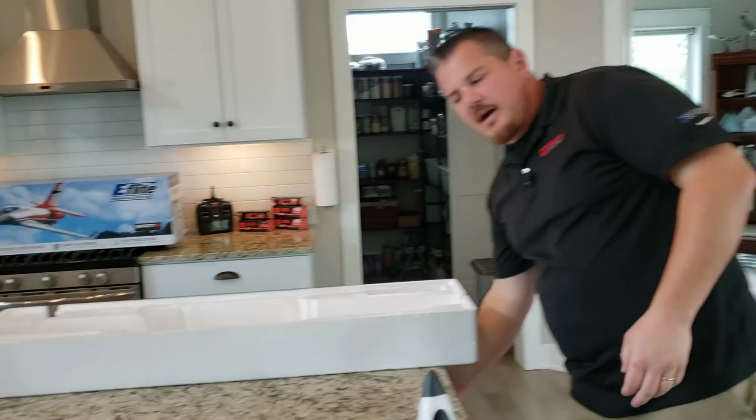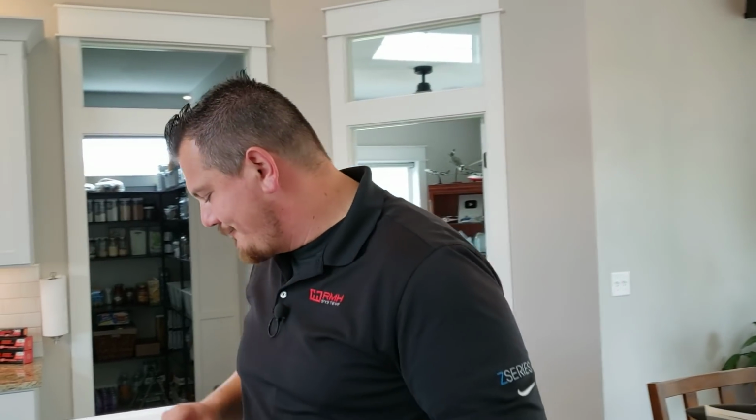Now that being said, another thing too, the other day I was pulling an AR631 out of a plane that may or may not have been destroyed by me. Anyway, you'll never hear about it on the channel, except for here. And I did update the firmware on the 631 using the programming cable, and I went into the menu, into forward programming, and reset the factory defaults, and guess what? I was able to do all the things I wanted. It worked gloriously. I was super excited about it, and no, it was not this plane.